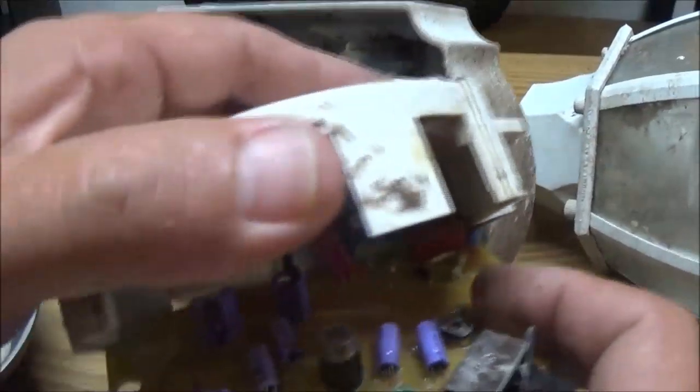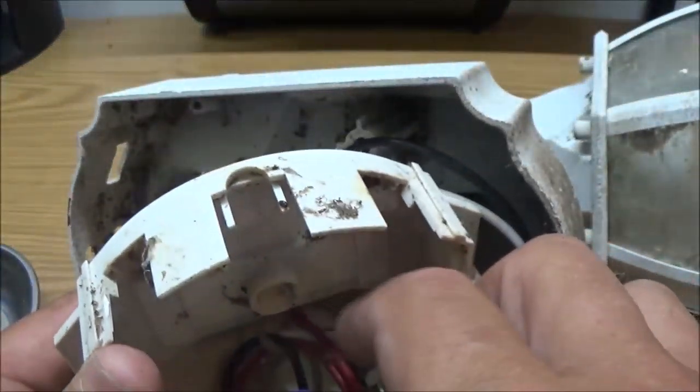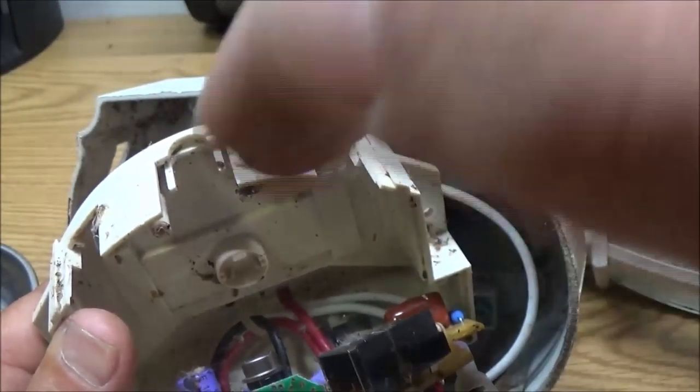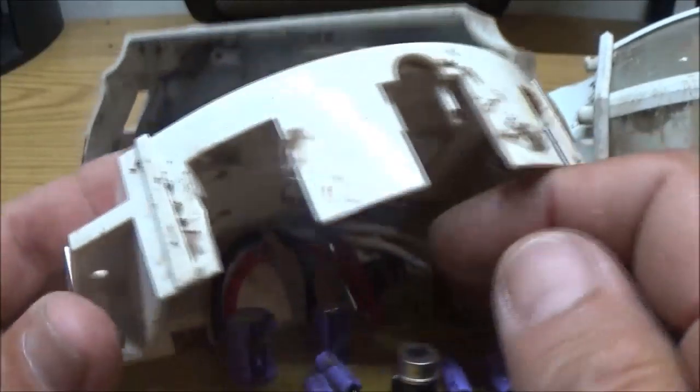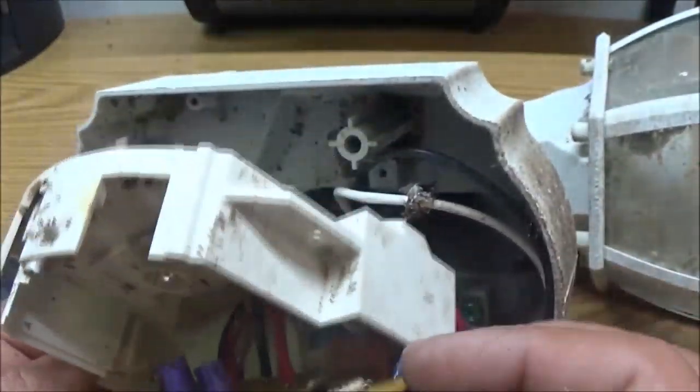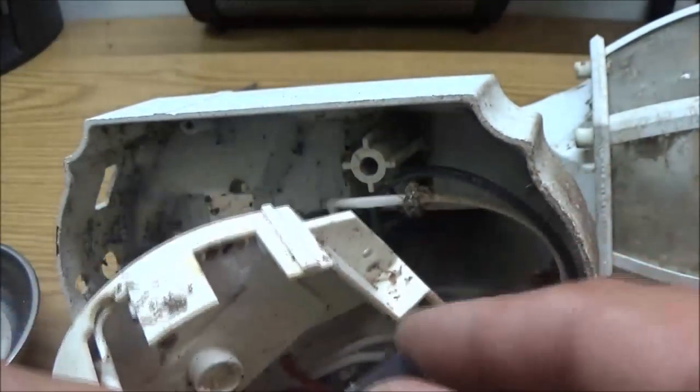These purple things down in here are capacitors. If they blow, the top of them will be domed over. And these all look good. So I think these capacitors are all good, from what I'm seeing. But